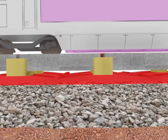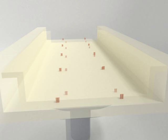The plinth element will have shear connectors that hold the plinth and the rail. Then the level of the plinth is adjusted to the required levels in line, and finally the stumps are cast in location.